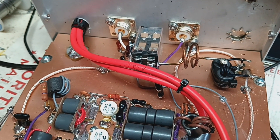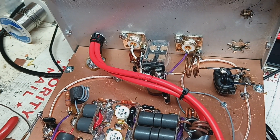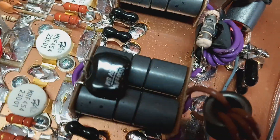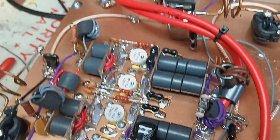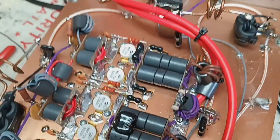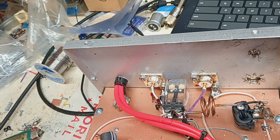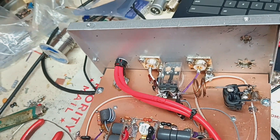It's a 70-watt transistor amp, so I'm gonna have to check everything in here. Right down to these — might put some metal clads on here. What is that? Thousands? One DM19 on the output transformer — that's got to go. We'll put 2879Cs in it. Basically it's just gonna need a full rebuild.